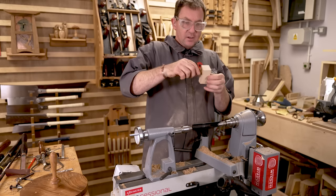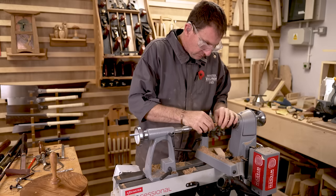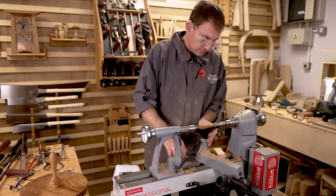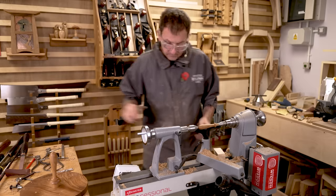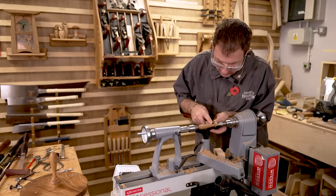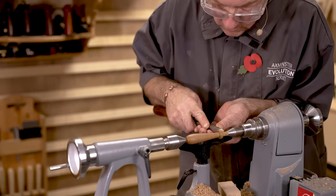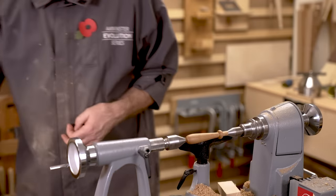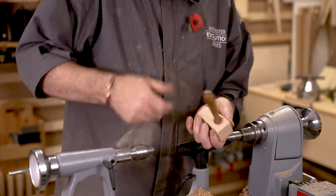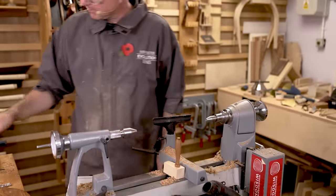Now I can screw that in. I'm going to hold it up to the light, check it sits square. If anything, I've got a little bit of a step right on the top. So, back to that. Beading tool, body a long way out of the way now, so I can get just into that little bit. Need a bit more tension. That should clean that up. And again, just going to double check that that will go all the way up. That's nice. Fantastic.